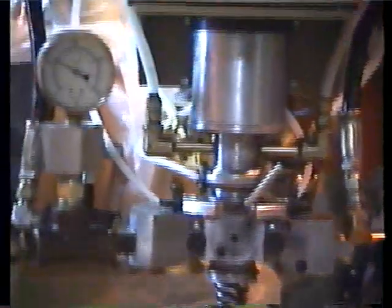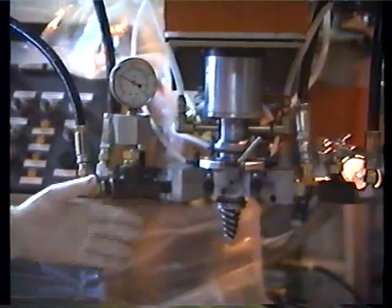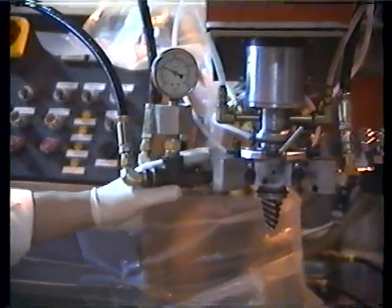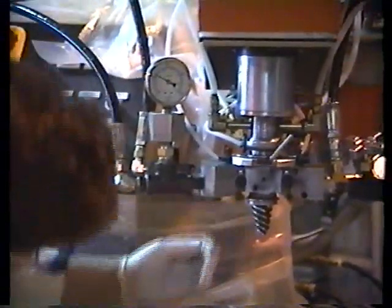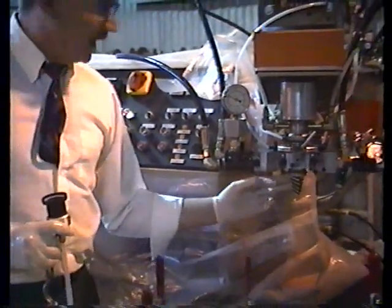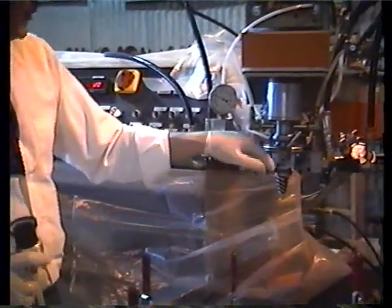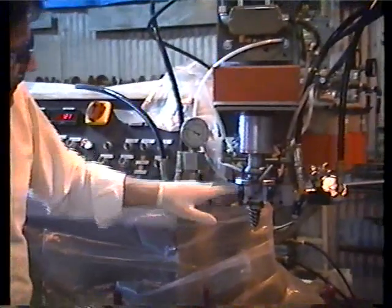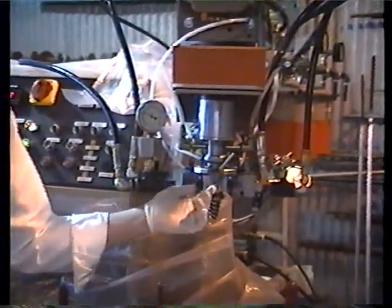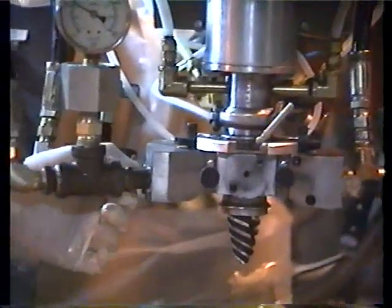The material streams — components A and B — are on independent valve blocks. This valve features a three-way valve assembly with several nice features. We have an external calibration port where material is dispensed into cups for weighing, calibration, and ratio checking. In the next position, we shift and reorient our actuator, and material is dispensed into the mix chamber. We control pressure both in calibration and pour by conveniently located adjustable orifices.